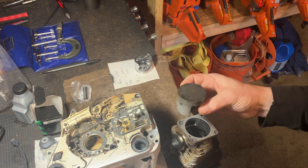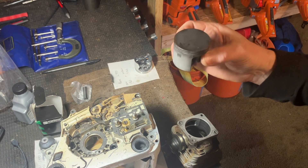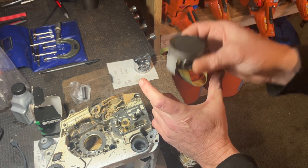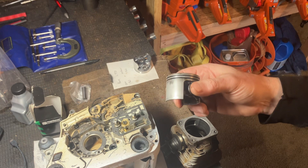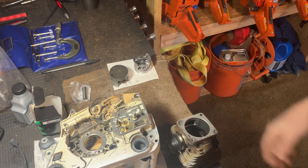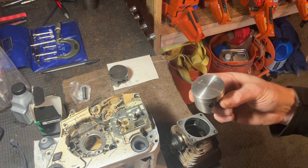You've got to remember it's sealing on its way up — as soon as it gets past the exhaust port it's sealing, and then she's coming down. If you have a bigger gap between your piston and the cylinder wall, you're going to be less efficient. I'm going to hang on to this OEM piston; I'm not going to get rid of it. These are not very plentiful. It's just that the guy who wants this done wants new bearings, seals, and a new piston, so this is the viable option.